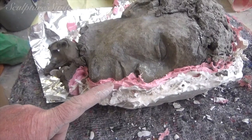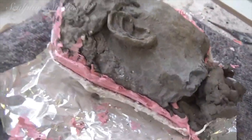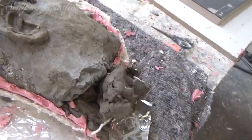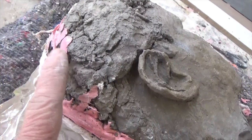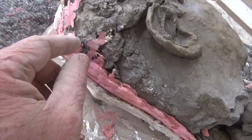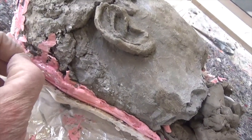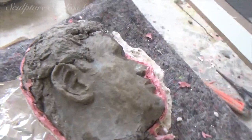There are a couple of areas that need to be patched where the material has completely broken away over time — a couple of voids and a few cracks — but the majority of the work and the essence has remained intact where it matters. You can see how the silicone rubber gets into all of the detail on its first liquid layer, perhaps a little too much, as you often need to pick out the rubber in order to clean up the mould.